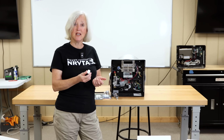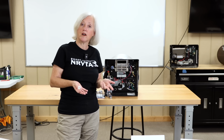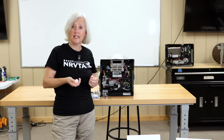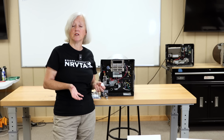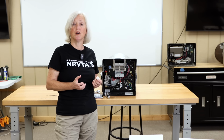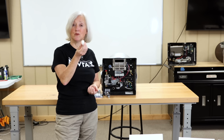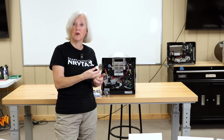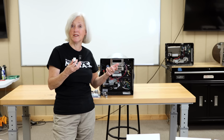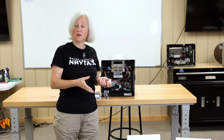We have an enclosed tank with water that's being heated up, and as it heats, the pressure is growing and growing in the tank. We have a lot of protection built into the water heater. Some of it is part of the electrical circuit, with components that maintain the water temperature, but we also have a couple of components outside of the electrical circuit, and this little teeny drain plug is one of those items, built in for safety. We need to prevent this tank from exploding due to the increased pressure. This little guy is part of what does that. It's the last-ditch protection for this water heater.